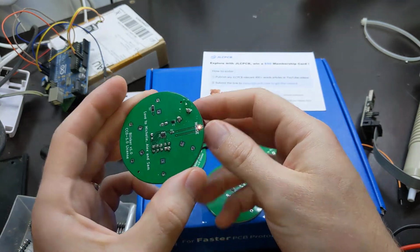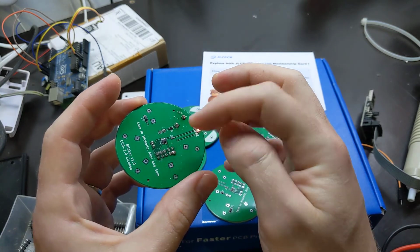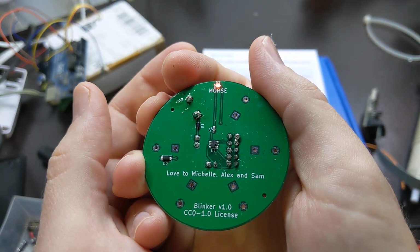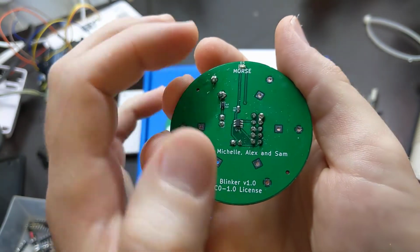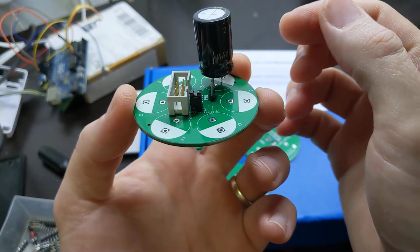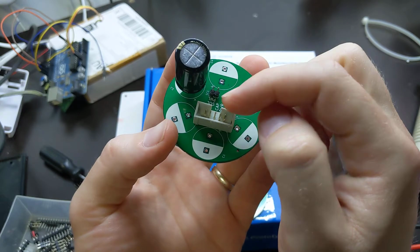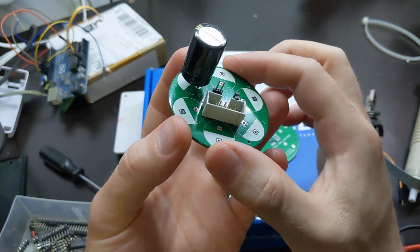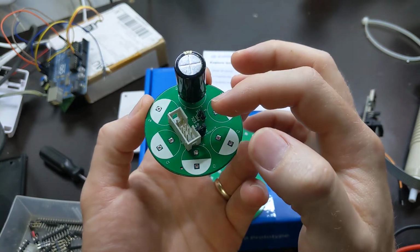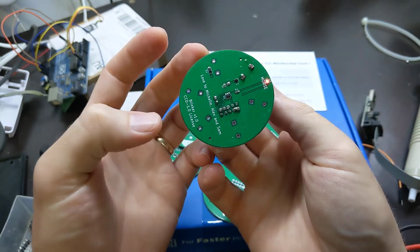So yeah, the solder joints are pretty grotty, especially where they go onto the big ground planes, the big heat sinks. Really hard to solder to those. So I'd use small traces on those ones that are connected to the big copper pads. And you see here you don't technically need this bit of plastic around it, but it makes it hard to put the connector in the wrong way around. But yeah, I had to solder on that cap, that super cap rather, and these 2 headers and that header, and she's away.